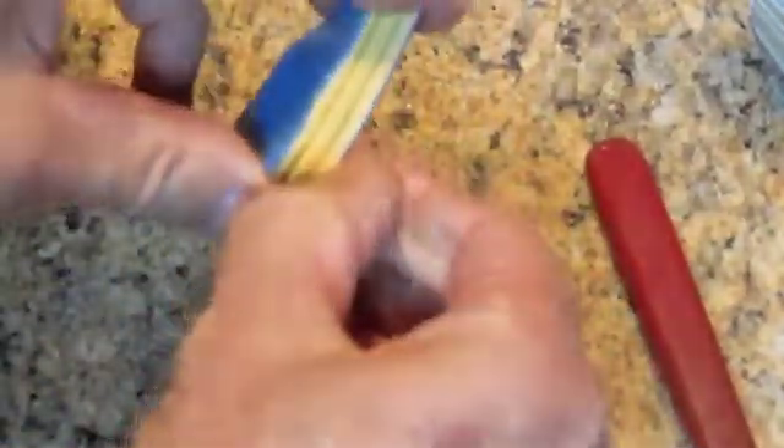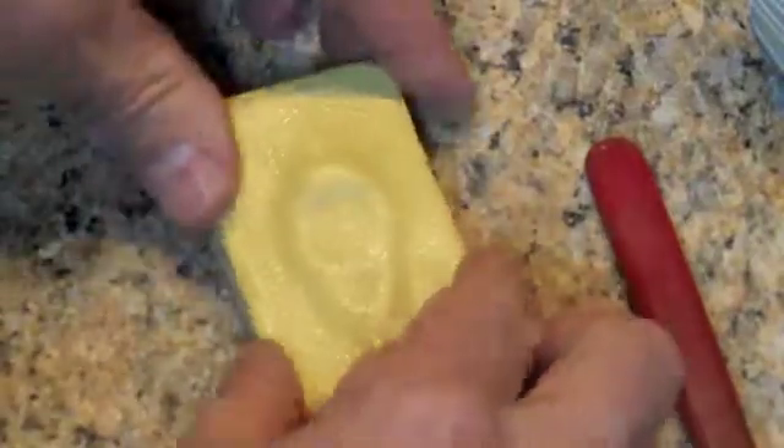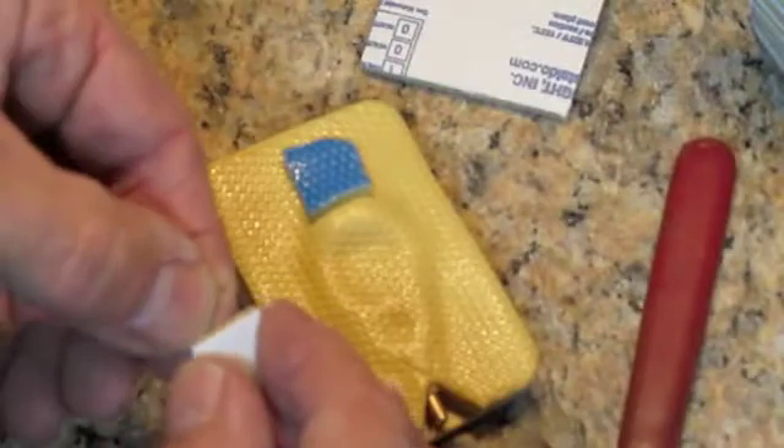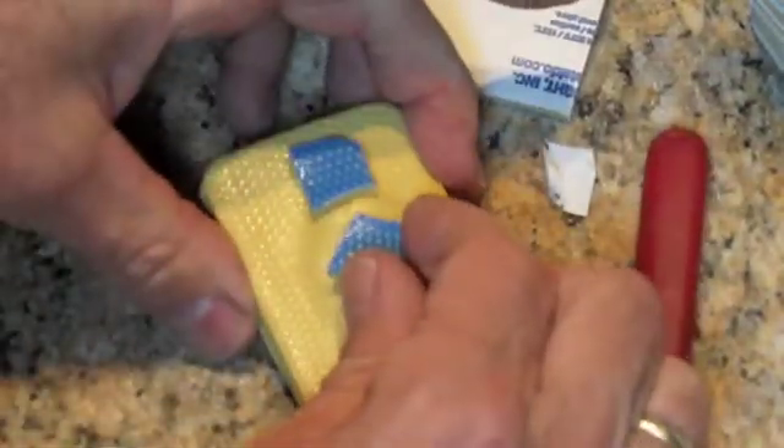But sometimes if you have lots of seams — lots of little pieces of rubber around the edge of the ring model — you can end up with maybe some oil from your skin or a little dirt from your hand, and that will cause a seam to appear in the rubber, which then comes out in the waxes that you inject into that mold.